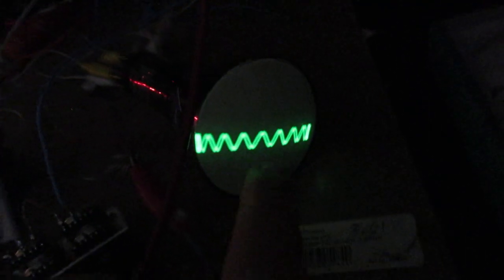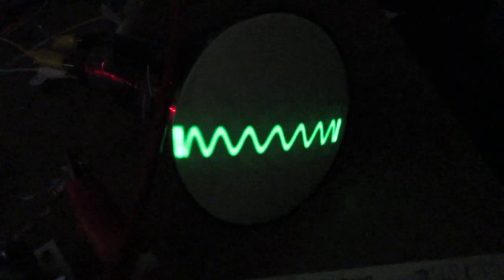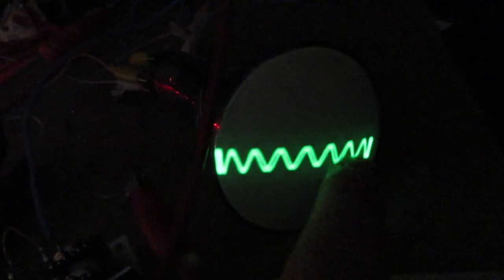Perhaps this waveform cannot be easily seen, but anyway, you can see here that the horizontal voltage now is good, and it works on approximately 40 volts. That's the output of my power supply. Here we have an AC output of 40 volts. So with 40 volts you can move the dot completely from the left to the right. That's very good. And also the sensitivity is okay, because we have here only 10 volts to drive the vertical plates.